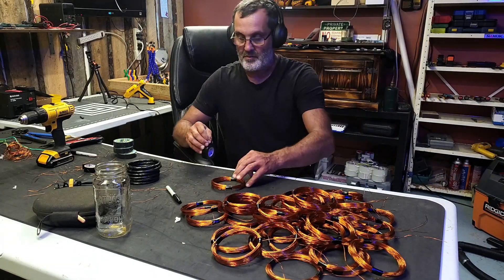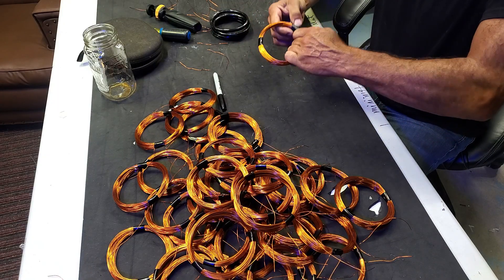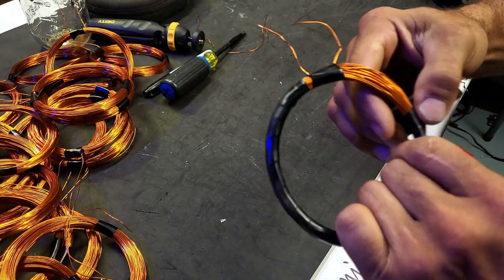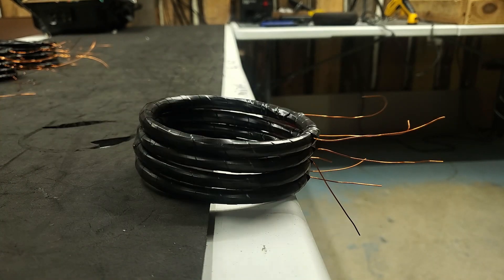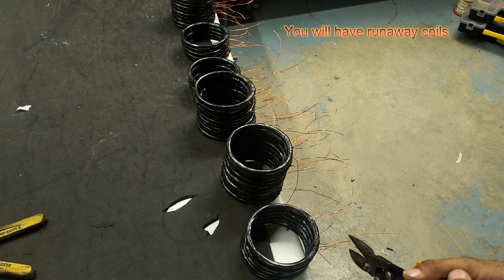You're just going to have to be patient and start making coils. I like to put my headphones on, listen to a good audio book, and just go from there. I spend most of my electrical life doing high voltage and a lot of taping, so I have the muscle memory to do these guys really quickly. But don't worry — take your time, just go around and you'll get it done. We use magnet wire, 22 gauge — that's what I like to use, that's what the math is done for, to go with the power supply and the ZK and the Naxian. Then pile them all up, get them all done, be patient, and just listen to a book.